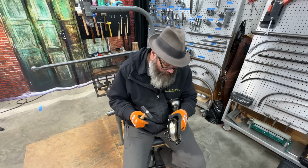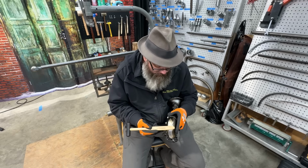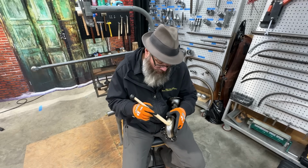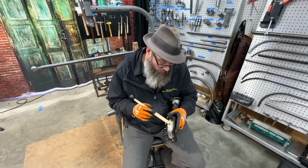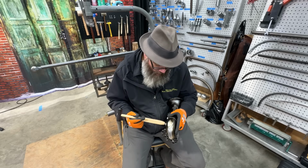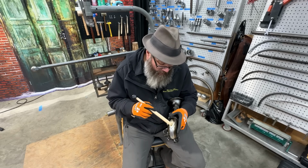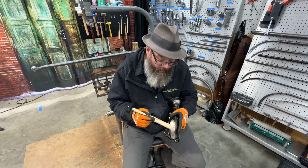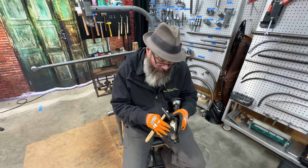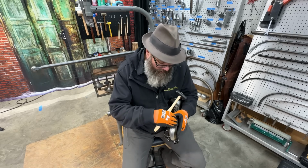Now there's another tip of what I did here, in that I only removed the solder back to about here. The reason that I did that is that the solder on the brass, the tinning, is so much harder than brass. It's crazy. I don't know why. Some metallurgists can chime in and say why. But what I do know is that this area that I worked did not have it, and I did not want the ball to punch and blow out and flare out anything back here. Yes, I could have hammer tapped it back down, but I do not want to change this area.